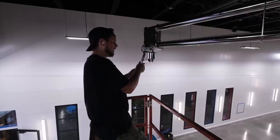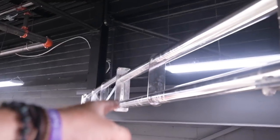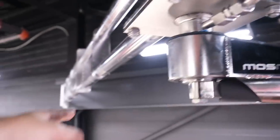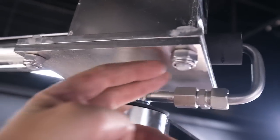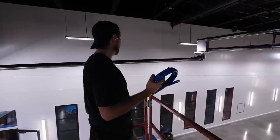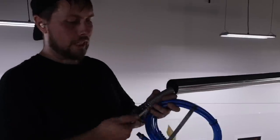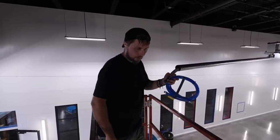So these are the fittings that I was working on earlier, just so you can see what I was up against here. When you attach that seam in the middle at the extension, you're going to need to make sure that this is oriented straight down, because once you tighten that flare fitting in the middle, where this is is where it is. I did have to get this plate up over this and then slide it over to get these bolts in. Now I've got to figure out how long to whip it. This comfort hose is 16 feet long, and I don't know if that's going to be long enough, so I might put a jumper hose on this. This is also a high-pressure swivel right here, which is kind of nice. The hose is going to be really flexible.